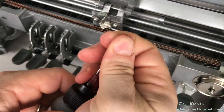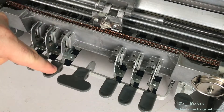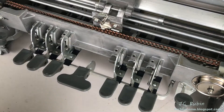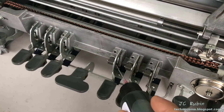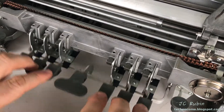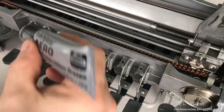Next, I'm going to use the clock oil and add one drop of oil to each of these bearings right here. We can see them — there are six of them, one for each key. I'm going to apply that now. I'll work it up and down to get the oil in. Now I will apply some of the aero grease over each one of those bearings.